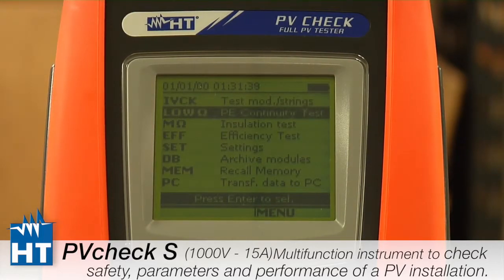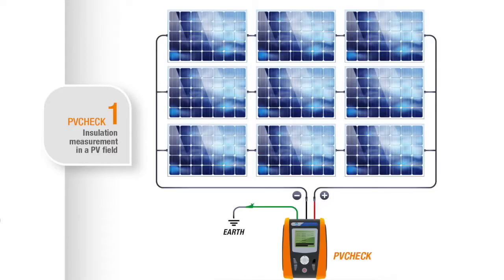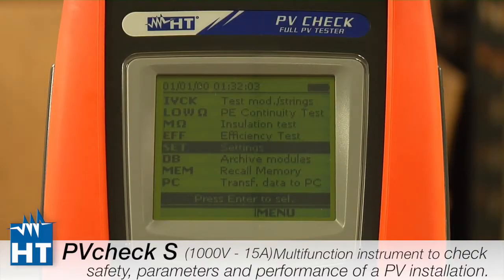Next we have a continuity tester. This is a standalone continuity tester labeled low ohms. Next down is the insulation tester, and this is for testing the insulation of the PV, and we'll show during a different segment how much better the PVCHECK can do that than traditional insulation testers. Efficiency is where we use a clamp and also the voltage out to figure what the power of your string is creating. Setup is where the next video is going to go, as to how you set up the instrument to be able to be used.